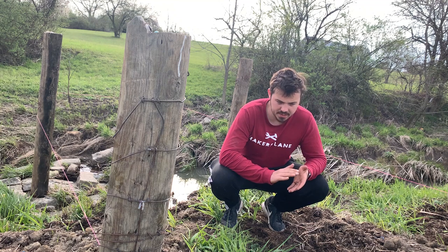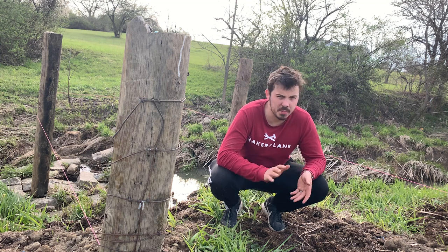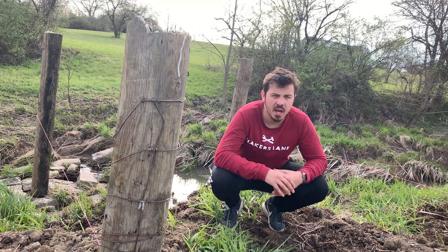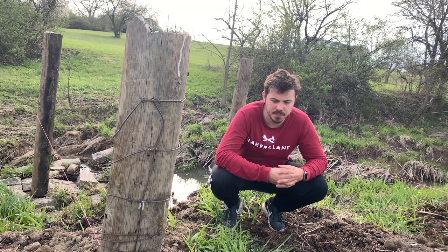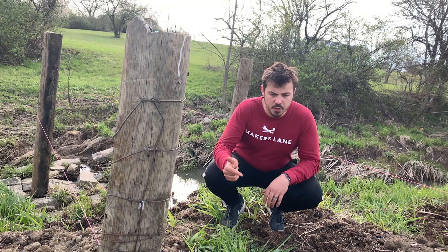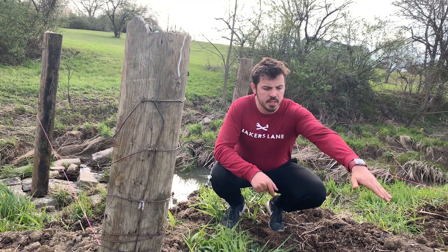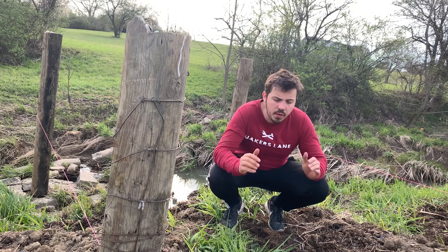So as far as the 2x8s, I have 4 16 2x8s and then 15 2x8x12. And then I'm gonna have to get a bunch of deck boards. I also got 4 inch lag bolts to secure it to the post. So even though there's 12 feet between these two posts, I'm gonna use 16 footers and then it's gonna go into the yard just a little bit. So I'll have a little bit extra on either side. So let's start framing up the outside.